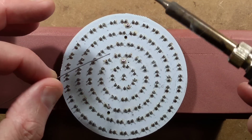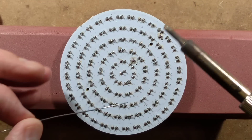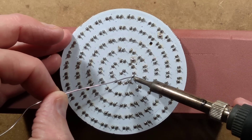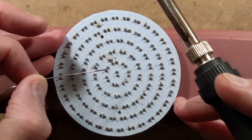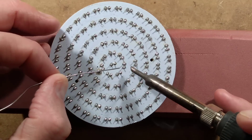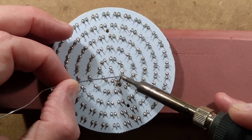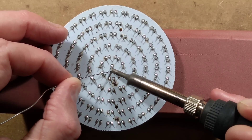One of the reasons I like this particular style of LED lamp is they're very serviceable. Although it might sound horrific, taking every single LED out of this is viable if you want a custom lamp. To remove LEDs from a panel like this, you can get a little bit of rubber sleeving — like silicon rubber hose — push it over the front, heat both solder joints simultaneously, and pull the LED out. It's very easy to change them.